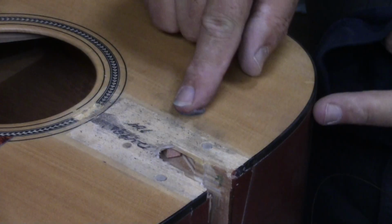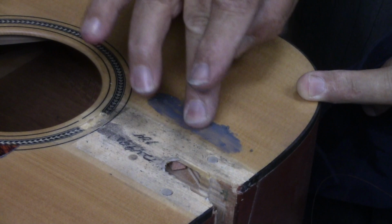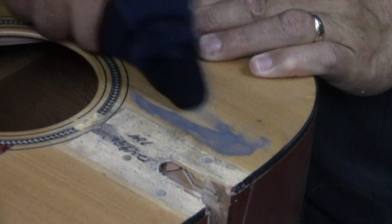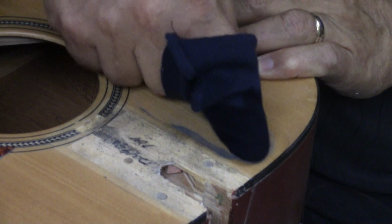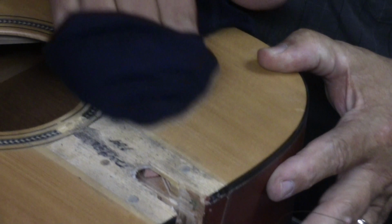Feel the smudging here. Just put a little bit of 3M final finish. You get it at any automotive store that will carry this stuff. There's a few different companies that make similar products. They're not burn marks, they're compound marks. Each time I sharpen that probe, I put a little bit of compound on it. So that's what you're looking at here. Those black marks will soon be gone. Voila! So now we're going to just very lightly sand again.